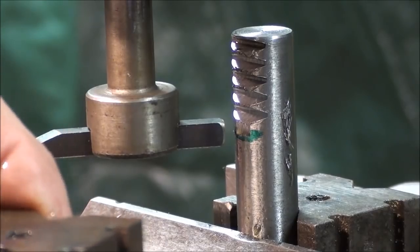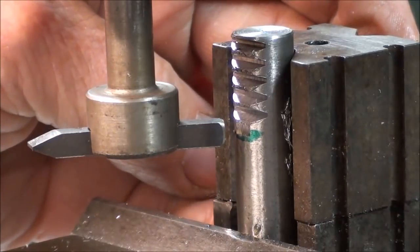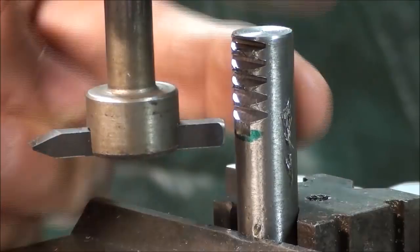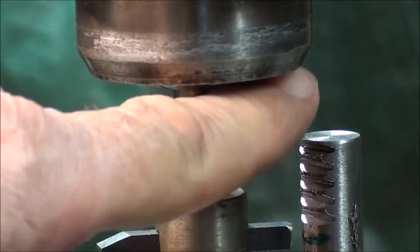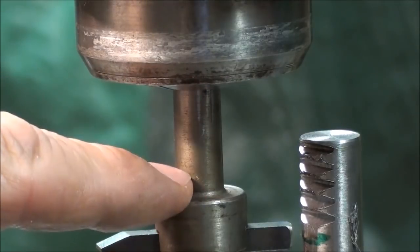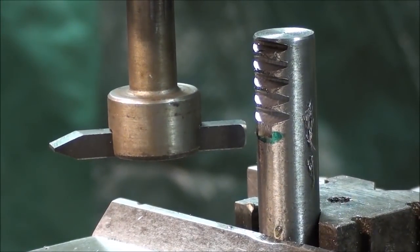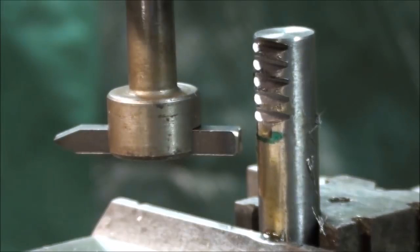This will be the sixth and final tooth. Now if I would have had a V-block that was longer than the one that's in the vise, that would have come up like this and supported it - that would have been even better, because naturally there's going to be some vibration here, even in half inch stock. And it would be a worse problem if the work was smaller diameter. Notice that I do have a little room here yet, but that would be the limiting factor on how many teeth you could cut, as well as how much shank I have here. There wasn't a whole lot of extra shank there, so in my estimation I'm holding it rather precariously as is. Rigidity is what it's all about, and it's really tough to get a setup like this that is rigid enough, at least for my standards.